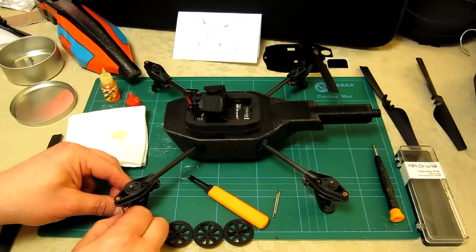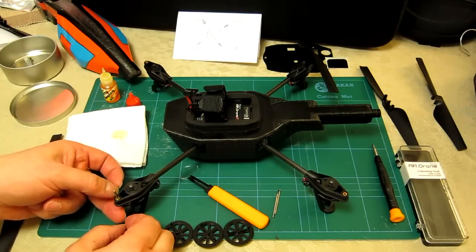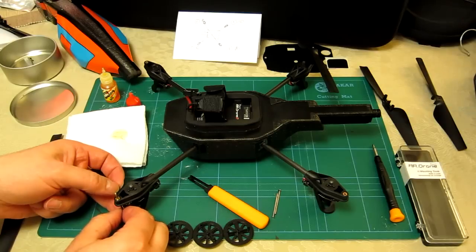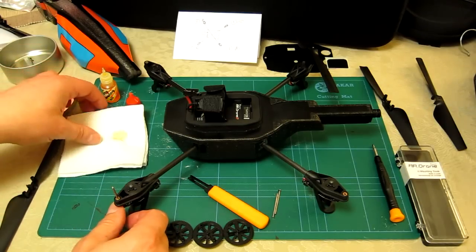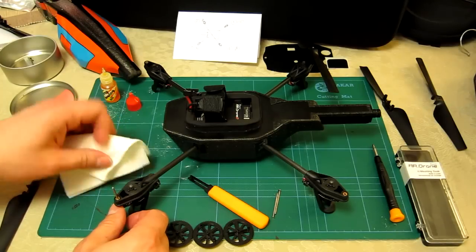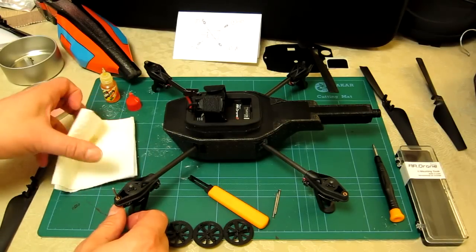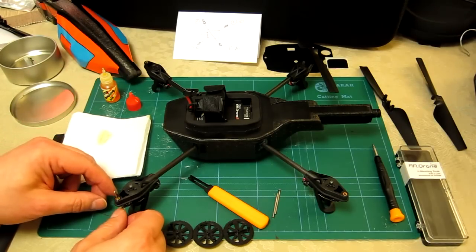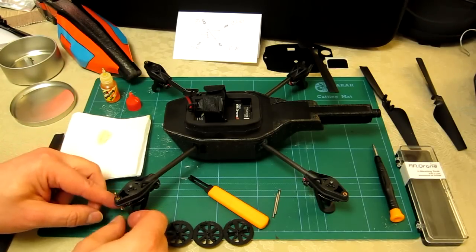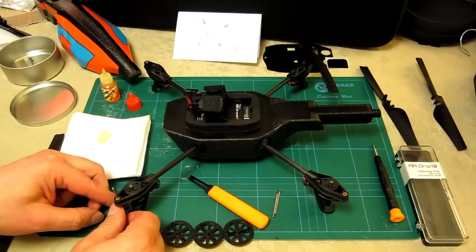By lifting and lowering the shaft through this and basically feeding it up and down, I know I'm lubricating the shaft pin very well as well as the bearing itself. I've applied a little bit too much — more than one drop there, apologies. This is a good use for a tissue; you can use a cloth, but this oil isn't going to wash out of a cloth very easily. If you've got a rag at hand, absolutely, but don't use a towel or anything from your kitchen.